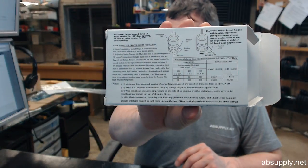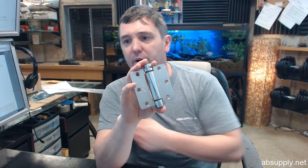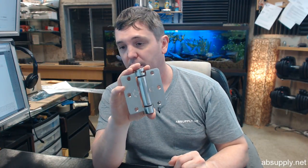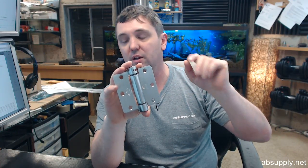The Certifications and Hinge Selection Guide — the final link, also printed on the box — will give you a guideline for how many hinges to use based on the weight of the door. For a 3.5 by 3.5 hinge, if you have a seventy pound door they want two spring hinges and a ball bearing regular hinge. Make it a ball bearing hinge by all means and install that ball bearing hinge at the top location, with spring hinges at the middle and bottom. The last place you would put a spring hinge is in the top hinge location.